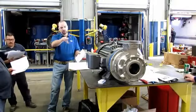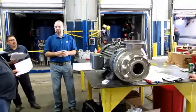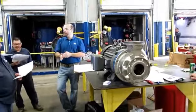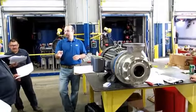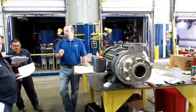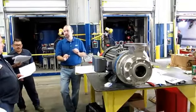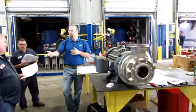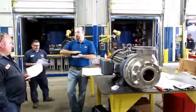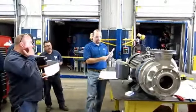When we go to take this pump apart, for that stationary seal face — don't drop it — if that fit is bad, and you've got dirt, debris, corrosion, or whatever in that bore where the seal head fits, and you press a new seal in there, it's going to squeeze and distort that seal. It might chip it, damage it. At the least, it's probably going to squeeze it and make it oblong, and then it's no longer flat. So we need to make sure that's a critical spot that stays clean.